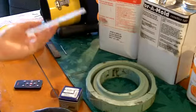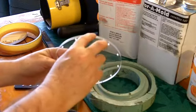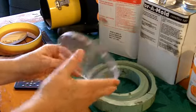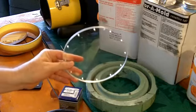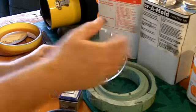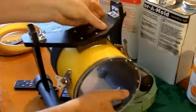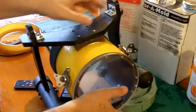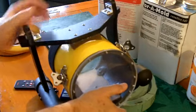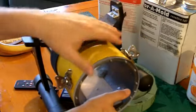Alternately, you could use another method I've used before on other housings — I didn't even use a lens cradle. I just attached latch keepers directly to the lens and it worked out pretty good. The one disadvantage is there's not much room for error. You have to get your lens on perfectly because at very shallow water depth the only thing holding the o-ring and keeping water out is the pressure from your latches.